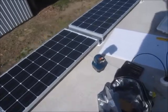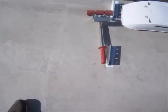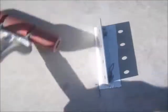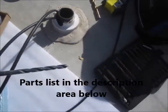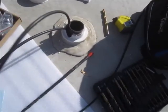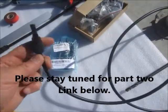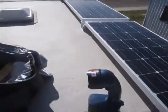All four panels are mounted and I can't wire them up yet — I'll tell you why. I had room for one more panel on this run so I went ahead and mounted the last brackets so it'll be ready, just a bolt-in. They ran the wire down the vent, wound up having to drill through the top plate because there was not room beside the vent pipe. I got my connectors today from Renogy, but I did not get a five pack of the MC4s to make my connections to the panels — probably won't get those till Monday. I'll show you that.